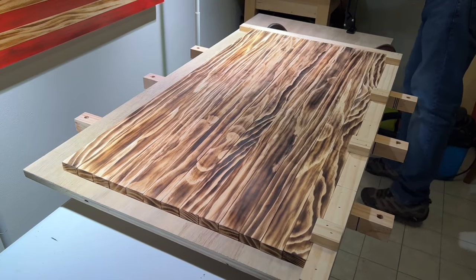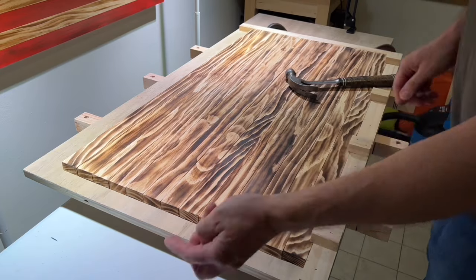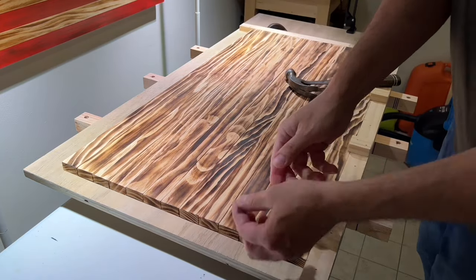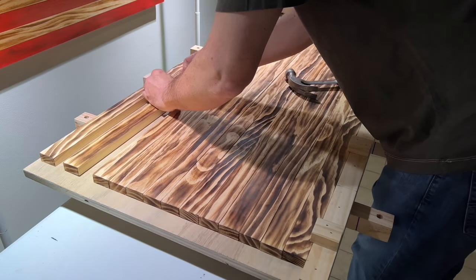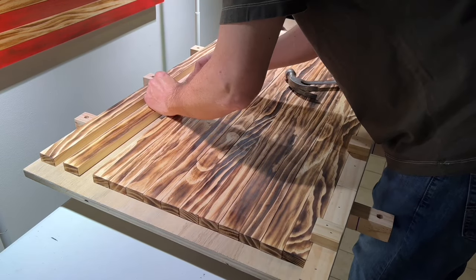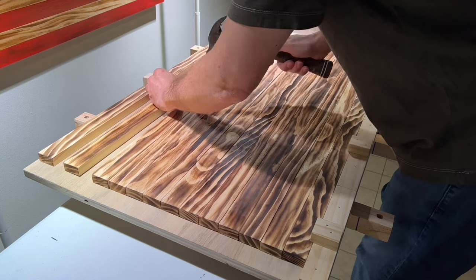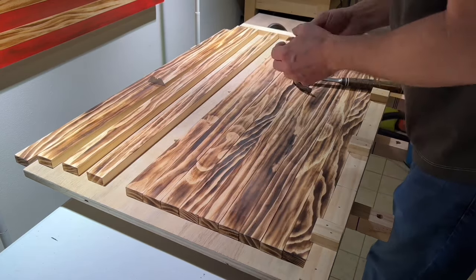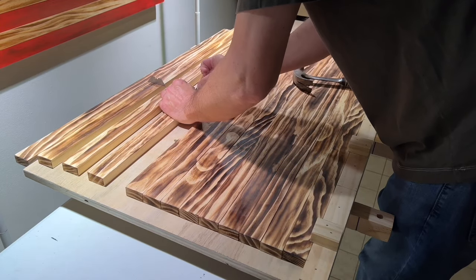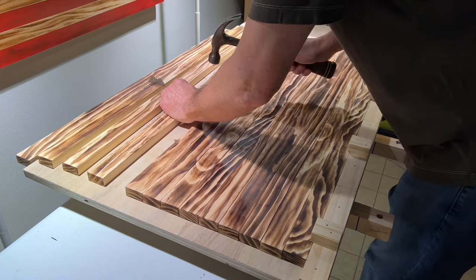This is a cool little trick. So to mark the union, you're gonna take a utility blade and hammer it in on those pencil lines. This will stop bleed over from when you're doing the stain. I've tried the painter's tape in blue and green, and I always end up with bleed over. If someone else has a different trick, comment below on it. But I find out that the utility blades work perfect. Now make sure you hammer them in hard enough where they stick into the wood a little bit. You'll see in a moment here, after I start hammering the other two in, the top one falls out and I have to put it in a little deeper, but it'll work perfect for your stain.